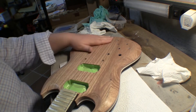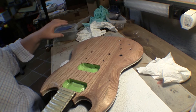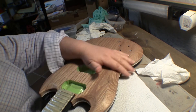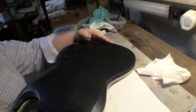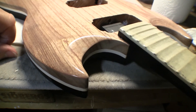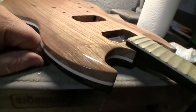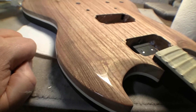Some days later - I can't remember when I did the last bit - and this is now wet sanded to 1200 grit, wet and dry. No disasters that I can see so far. I mean there are imperfections; this is not an exhibition guitar, that's for sure. However, I think we're getting there. Just for fun I had a go at polishing this upper bout area with the polishing compounds, and I don't know if it comes out on camera but this looks like it'll polish up quite nicely.